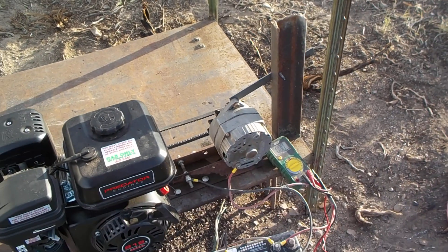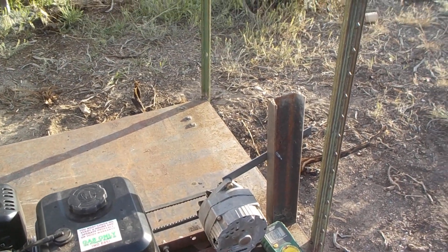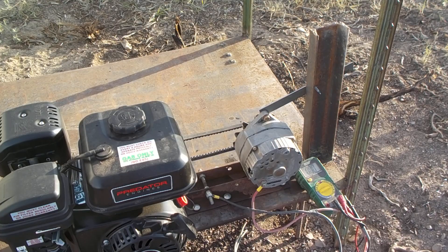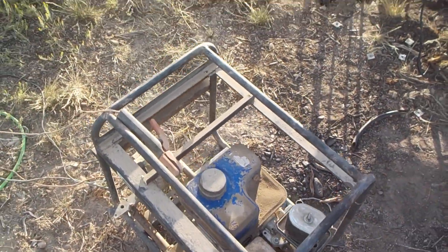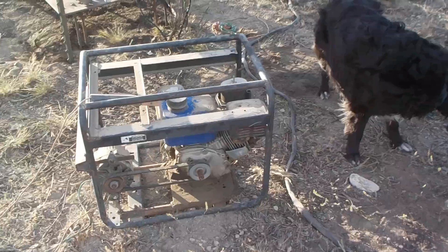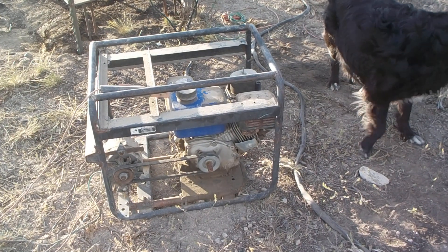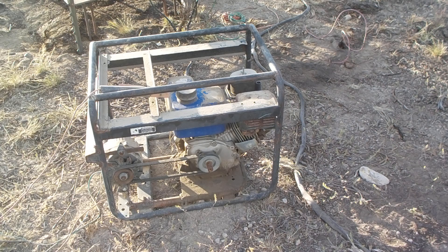These alternators have a lot of other possibilities. I'll include a little video — this is my portable welder. It's only very light duty, but with some minor modifications to the inside of these alternators, you can actually increase the voltage. I can make about 100 volts of DC voltage, which is a little bit high and a little bit dangerous, but I can actually use this to weld with.